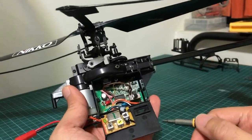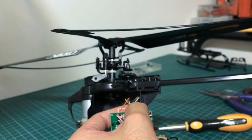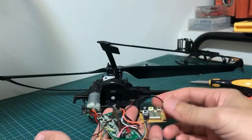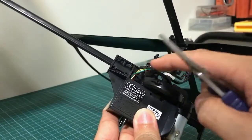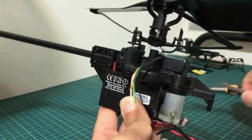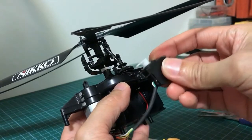This is how the inside looks like — there's a radio crystal here, and more screws. I've removed the circuitry and I'll keep it in case I want to use it for future projects. Here's a close-up of the roll servo — it has a lot of cables unlike the usual three cables on a regular servo, so I'm going to remove it and use a regular servo instead. I'll keep this servo for future projects.